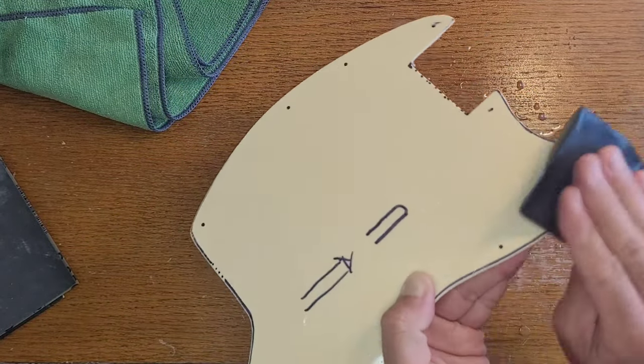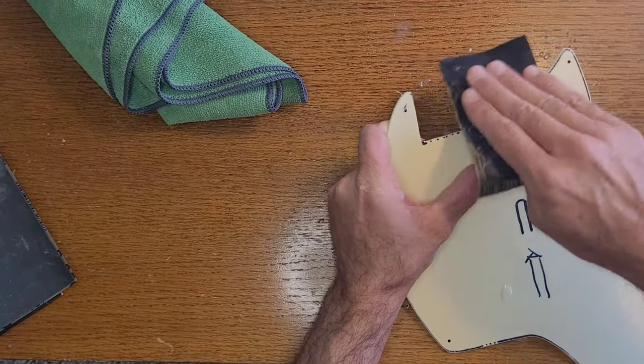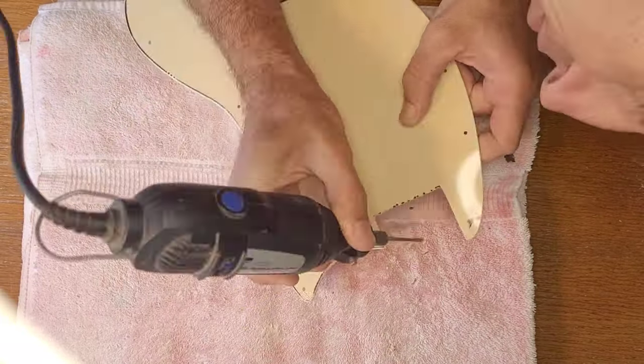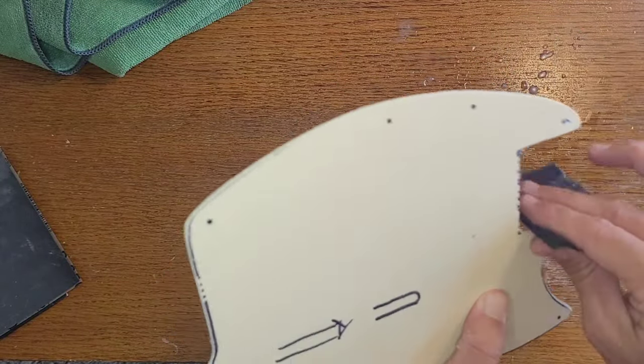You may notice that on the actual front of the pickguard, I've drawn kind of rounded off. It's kind of like a funny shape. And basically what it is, it's the profile of the edge that you should be doing. On these single plies, you should have a slightly rounded top and bottom where it meets, versus a Fender where you just still have the ramp.